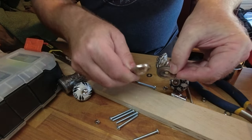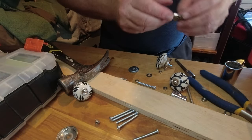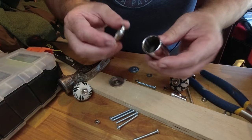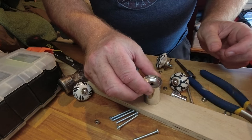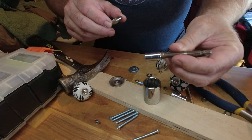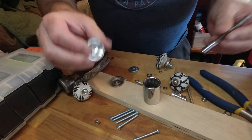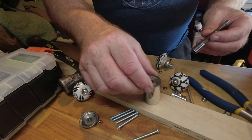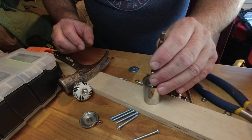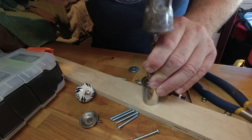What I have to do is reshape them, and I did figure out a little workaround. It just so happens when I take a good one, I have a socket that fits the socket perfectly. Then I have a socket on an extension that fits into the other piece. So what I'm doing is putting them in the socket to hold the outer edge, then simply banging down and stretching it the opposite way.